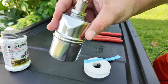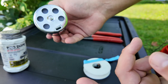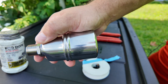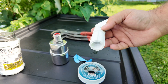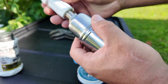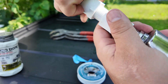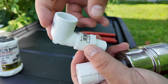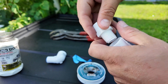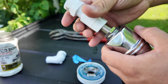Back to our makeshift table — we're going to get this float valve ready. Once water reaches a certain level, it shuts off and no more water can get through. It's pretty simple. I had to order it from Amazon, I'll leave a link in the description. We need to create an adapter ending with a 90-degree angle, connecting the float valve straight into a threaded coupling to a male adapter, with a street 90. In order to do this correctly we need to put both Teflon tape and pipe dope on the threaded areas.